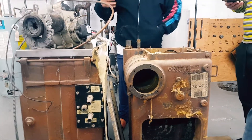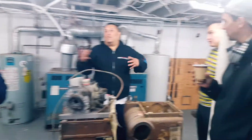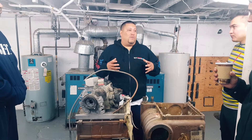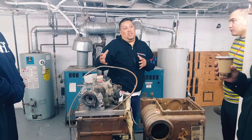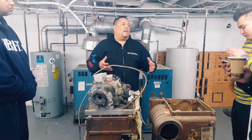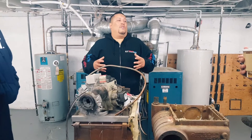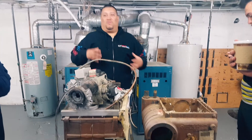What they don't tell you is — and guys tend to forget — is that that circulator pump is designed for hot water. What do they tell you about steam? You're making steam at 212 degrees. Those hot water pumps, or hot water systems, are between 160 to 180 degrees. That's the difference.